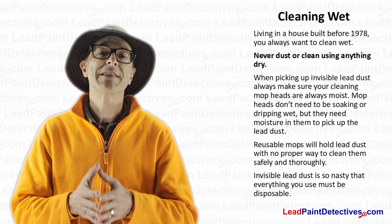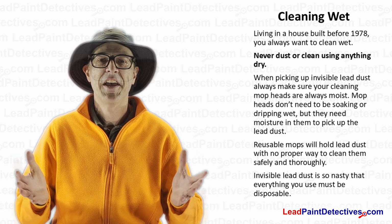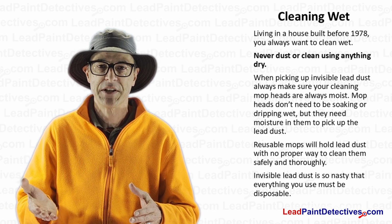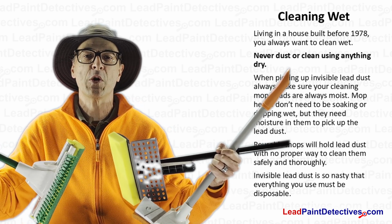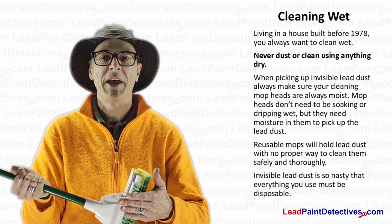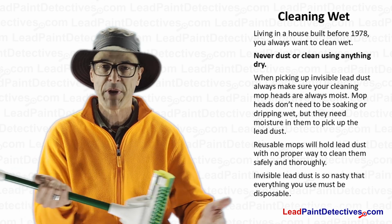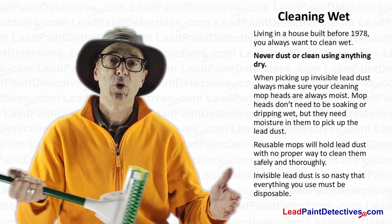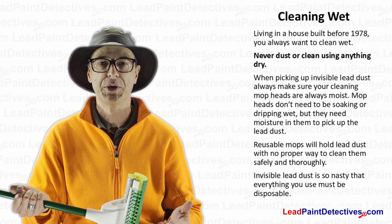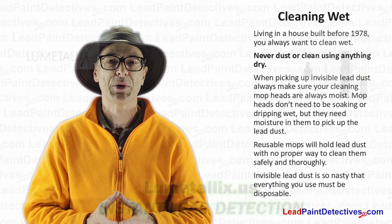Never clean or dust anything dry. When picking up invisible lead dust, make sure your cleaning mop heads are always moist. Mop heads don't need to be soaking or dripping wet, but they do need to be moist so they pick up the lead dust. Reusable mop heads will only hold lead dust, and there's really no proper way to clean them safely and thoroughly. This mop head even has a scrubber on it, which, when you're dealing with lead dust, you do not want to be scrubbing back and forth. If you're scrubbing back and forth on the floor, it's very possible you could embed lead dust right into your floor, causing more issues. Invisible lead dust is so nasty, everything you use must be disposable.